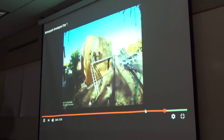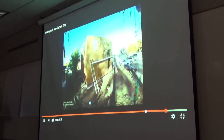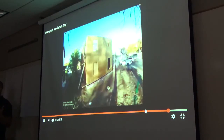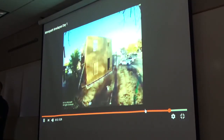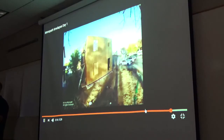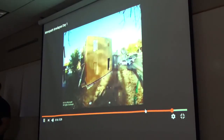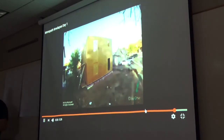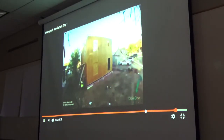Now we've had it before where the person on the outside, set up on a ladder or scaffolding, is driving a bunch of stuff through and left a dozen screws sticking an inch into the building. Membrane was already up, insulation was up, and we've got these fasteners sticking in. You just go and zip them off with a grinder. It's not that big of a deal.